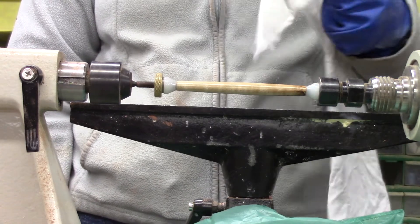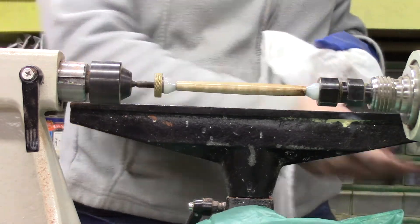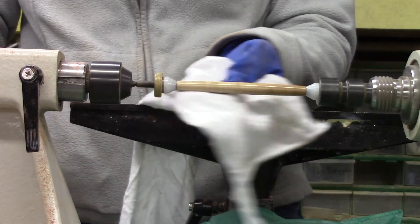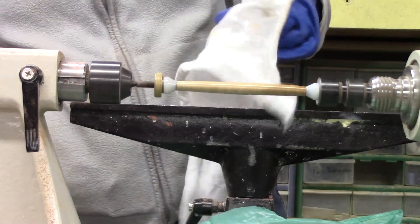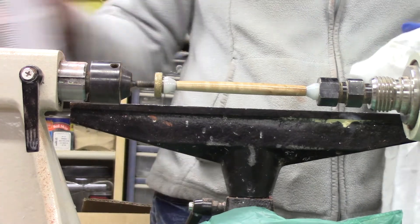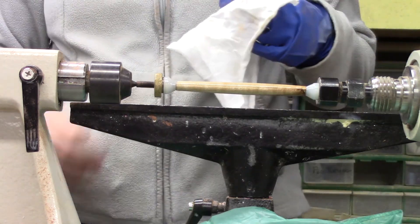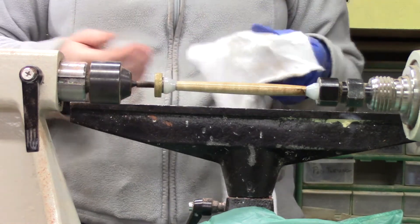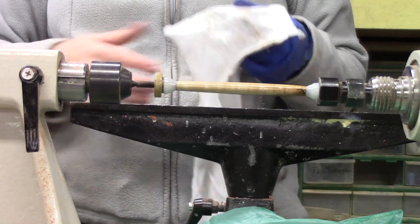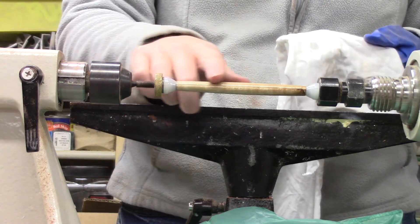The goal is to make sure you don't get any shop towel in your finish. Always give your pen a spin and make sure you don't have any extra white flecks in there. You're going to do this about five times — I haven't really come up with a reason to do more than that. When I was doing this just with the CA and didn't have the activator, I did about ten layers. If you want to do micro mesh sanding when you're done, then do ten layers so you have enough CA before you hit the wood. But because of the finishing polish I have, I don't need to do that, which means one less sanding step.